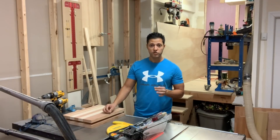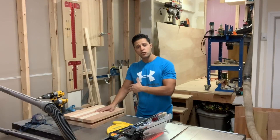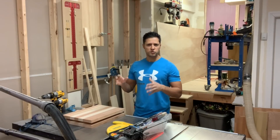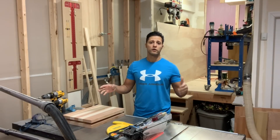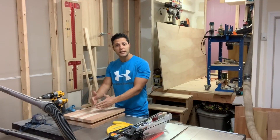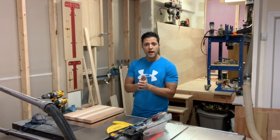After 24 hours you can do the final milling. I like to keep these boards as thick as possible — these are still a little over an inch, about an inch and an eighth. I pass them through the planer and hand plane them. After hitting the jointer, I hit the table saw. I rough them out on the miter saw first to get them to a more manageable size — working with smaller boards is much easier on the jointer. Leave them a little longer for the planer so you can cut off any snipe.